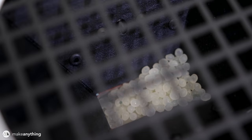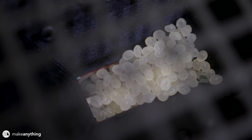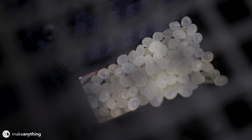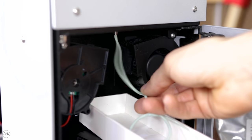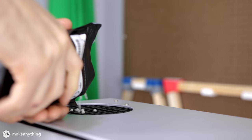Here you can catch a peek of the extruder screw pulling in the remaining granulate and feeding it through the heating chamber. Since I'm done for the night, I'm just going to let that remaining plastic extrude all the way through the system, and then to make sure it's clean for the next run, I'm going to put some Devo Clean in and run that through as well.